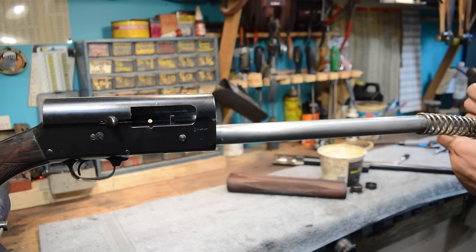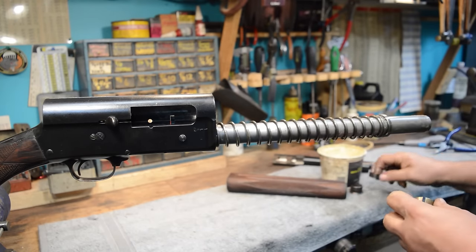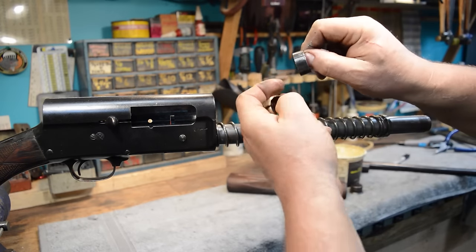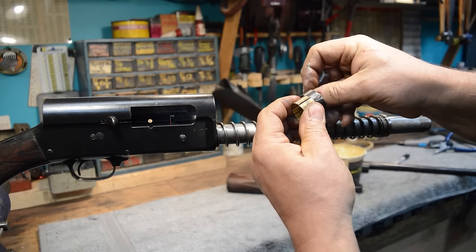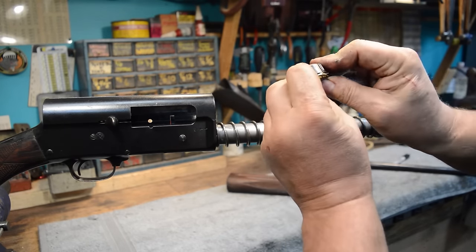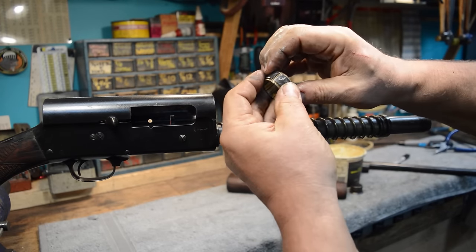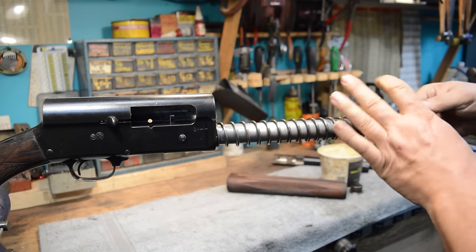Let's put that in there and set that on here. Make sure that the notch in this ring is set over the notch in this ring. Don't put this split down that side, because then this thing can't properly move. That will go there.